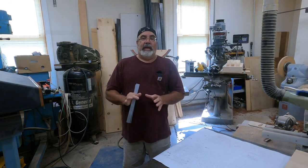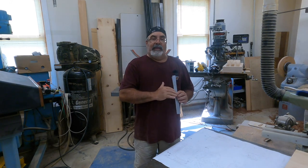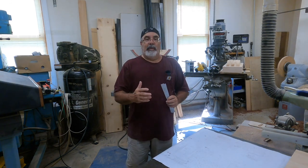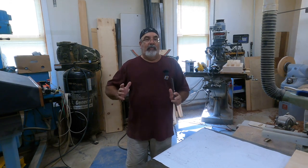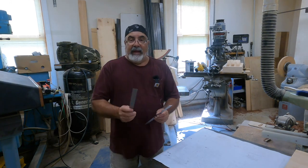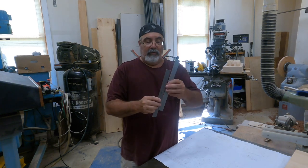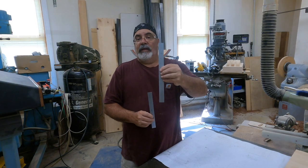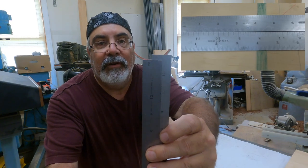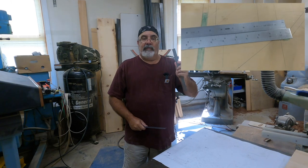A lot of guys are not understanding going from either the casting to a layout drawing, and getting from basically 2D — which is a drawing — to 3D. That's basically what pattern making is: we take 2D and make it physically 3D. So first off, I've got a standard 12-inch ruler that machinists and everybody else uses. Here's my shrink scale, which is a quarter inch per foot — so you can see that's actually a quarter inch different, and all the increments are just a little bit longer. That's what I'm using for this steel job.